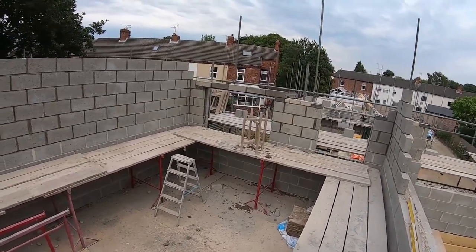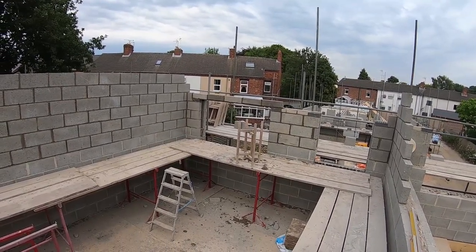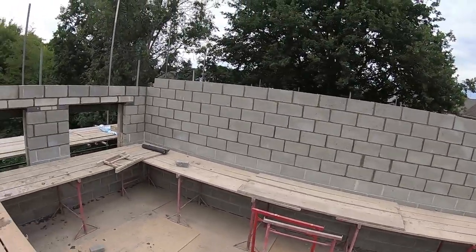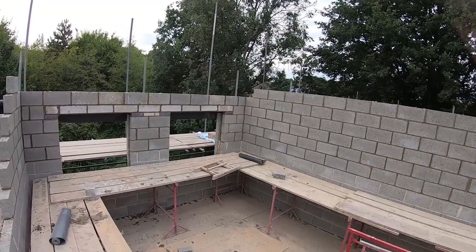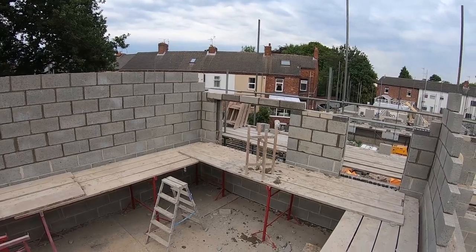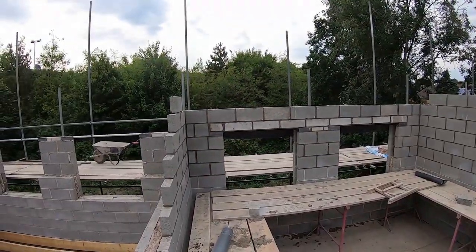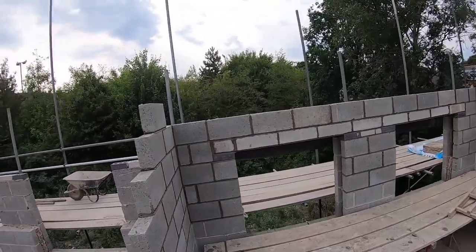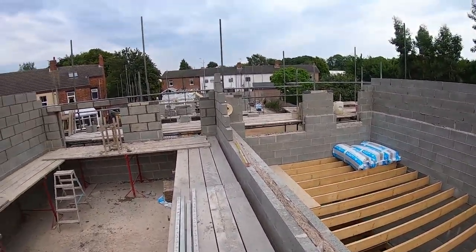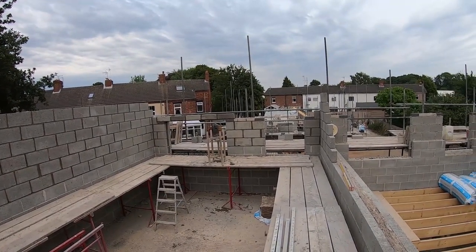So what I've done is run that split course across, and once all that's stiffened up and gone solid, I'll run the full block across the top, because I think it's the full block that's causing it to sag, with more weight. It shouldn't, because it's one solid unit and made stronger. So that's up to wall plate on this one. Got these on, damp on everything, corners up, and then all it needs is to run this in and then work his way out of the plot.